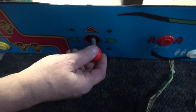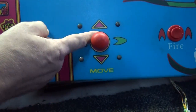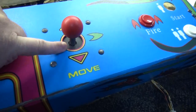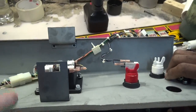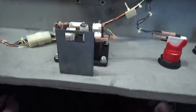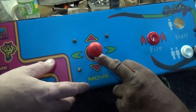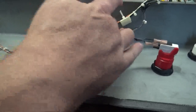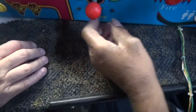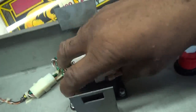The joystick here — see how clean it came up. Now, the customer said the joystick was sticking. It could be in here — do you see that ring inside that's flopping around? Once it gets under there, you'd probably have to take the joystick out completely. Not just the handle — you've got to take the whole thing out, because it's in between the joystick housing and the control panel. If you're lucky, the knob might pass through the hole, and you could leave it on and just take these four nuts out and take the whole panel off — but it might be a little too big. In any event, you have to take the whole mechanism off.